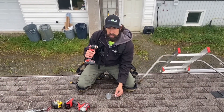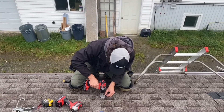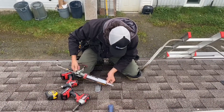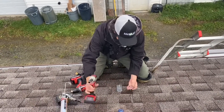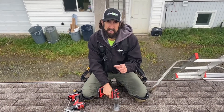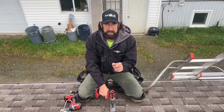Another tip: if you're drilling into your trusses, you can take a 1/8-inch drill bit and pre-drill your hole at 90 degrees, apply your sealant, and then drive it in with your impact gun. The reason you might want to do this is if you're working with older trusses — the wood can be petrified and hard to get through. And if you're worried about not catching the center of the truss structure, pre-drilling will prevent splitting of the truss.